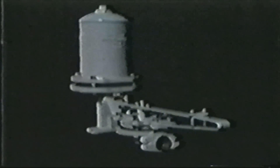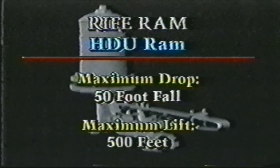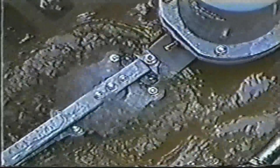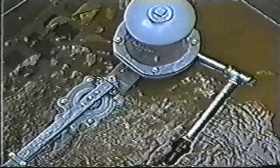Each installation should include a strainer to prevent debris from clogging the check valves. Strainers are available from rife. The rife ram product line consists of the HDU ram for a maximum fall of 50 feet, lifting as high as 500 feet, and the Davey ram for smaller flows and lower lifts. It keeps pumping 24 hours a day, seven days a week, 30 days a month, 365 days a year.